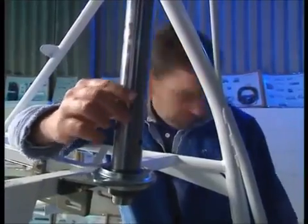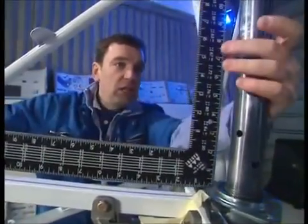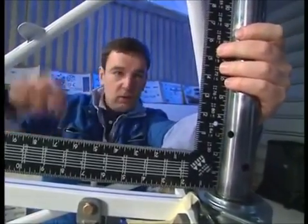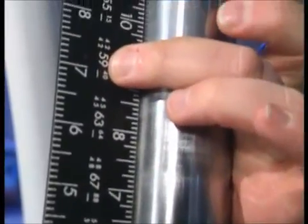It's worth three grand. Now the acid test is whether or not the shaft is exactly at 90 degrees to the square section tubes — and that is perfect. I've put an inclinometer on the other way and I know it's vertical in the other plane as well, so that is the top bearing installation complete.